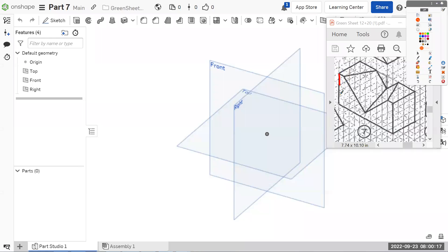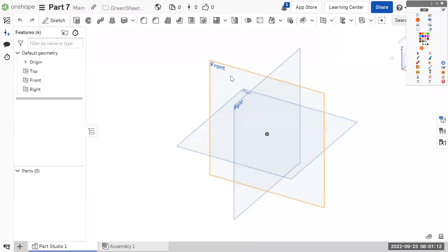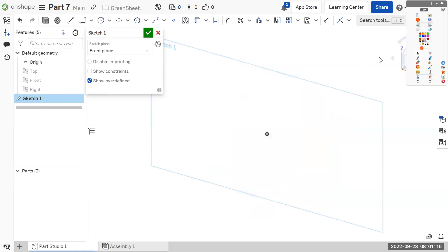The way we're going to do this for part seven is to make two sketches. We need to make a sketch of the front and a sketch of the back, which are very similar, and we'll have two sketches separated by four inches. I'm actually going to make the sketch of the back first. Across the back, the line across the bottom is 10, five up each side, three in — we'll sketch on the front plane, turn off origin planes, look at it straight on.